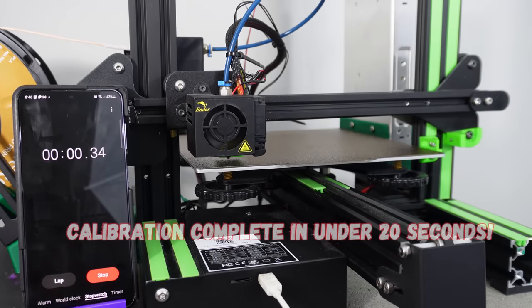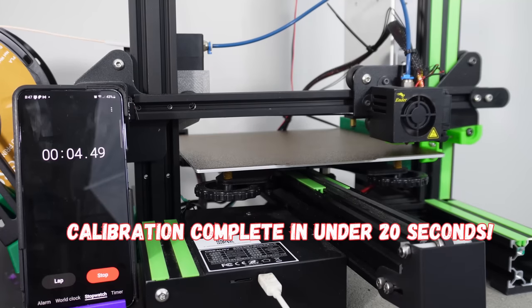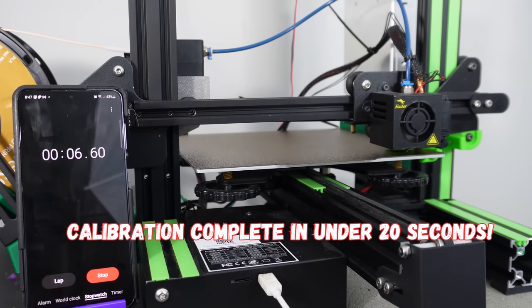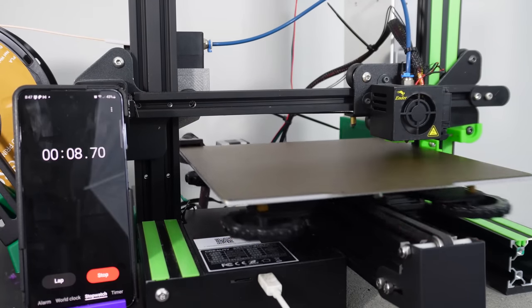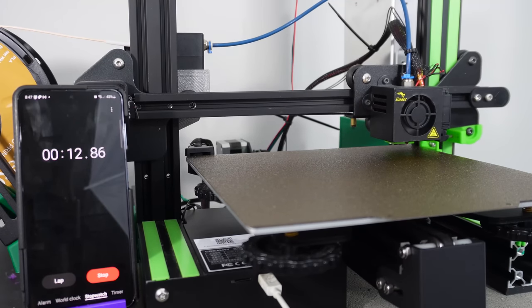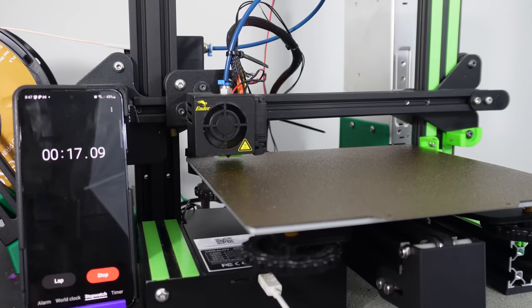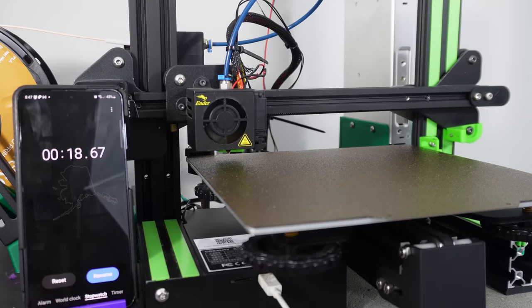That's right, Klipper firmware offers a built-in routine using a bed probe that will analyze your bed and calculate how much you need to tension each adjustment knob. This turns a 10-minute task into mere seconds and takes us almost virtually out of the equation. Sounds too good to be true? It's not, and we'll go over it today. And here we go.